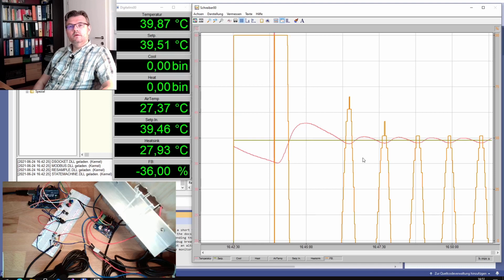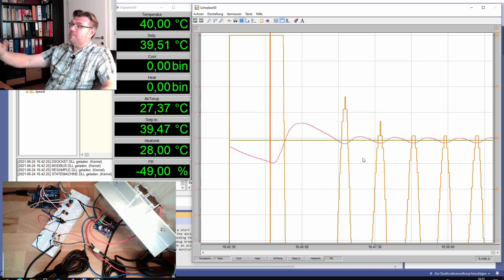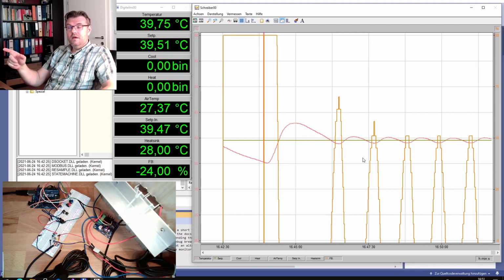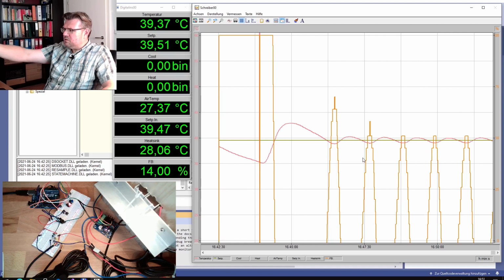Here you already see the disadvantage. Something is swinging and the correcting variable is going up and down like crazy. If we had this on a real system which is making a sound, this would sound frightening, and maybe we would then also use another approach. I just set the KP value to an insanely high value, and it seems for sure above the critical gain value.